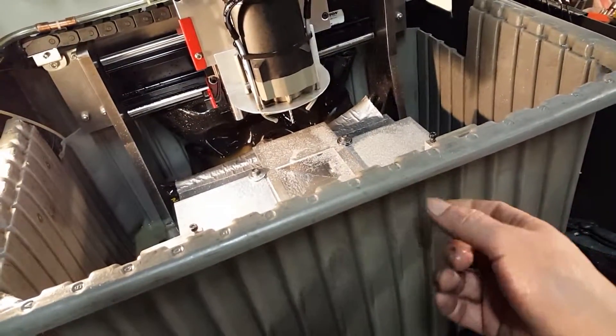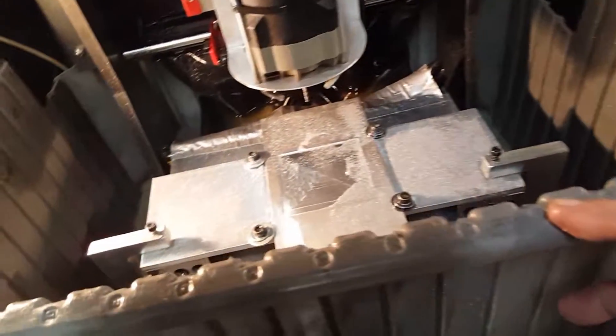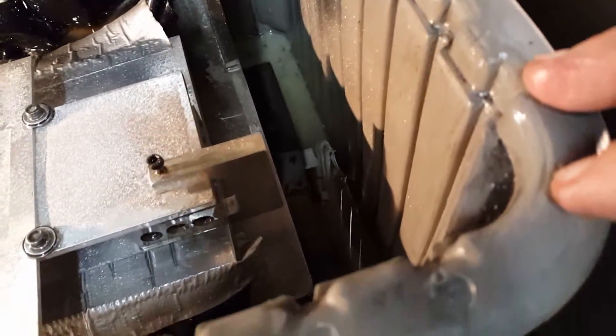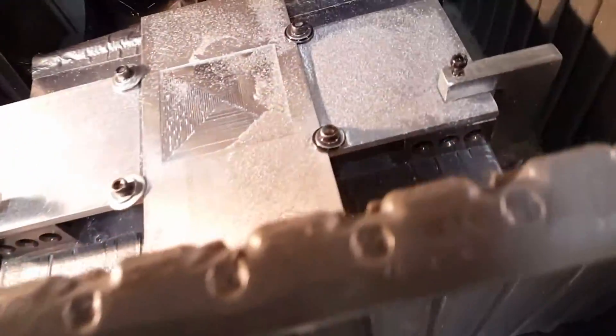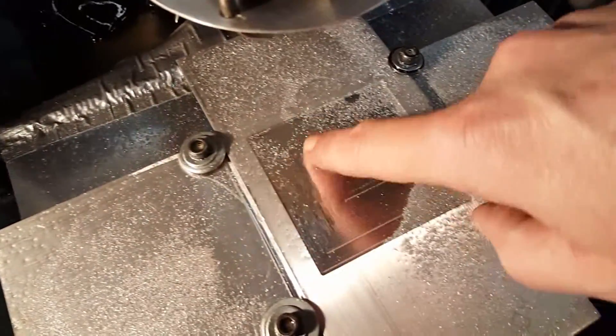Here's the flow back. I took an industrial plastic box — very strong — checked it for leaks, and checked that it wouldn't react to what I'm cutting with. The coolant comes out here and flows back into the sump. The surface is definitely clean — nice.